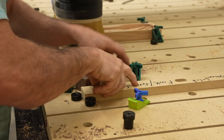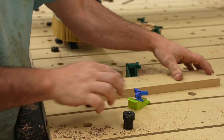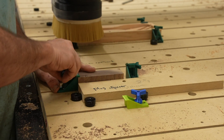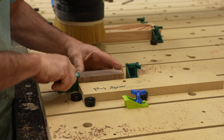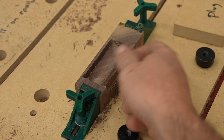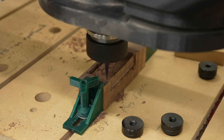The next step is to make the plug and I use a contrasting wood — in this case end-grain walnut. It's pretty important that it's end-grain in order to get good detail without chip out. I have a little spacer that helps align things to exactly where I need it to be based on my dowels. I use a different offset than what I did before and set up a V-carve. This V-carve is not on a flat surface — it's projected down onto a curved surface, and in order for the plug to work correctly it also has to be curved. It has to be basically the inverse of the shape I'm putting it onto. So first I have some tool paths that generate this curved inverse of my spoon handle, and once that shape is done I can actually make my plug with a V-carve inlay.